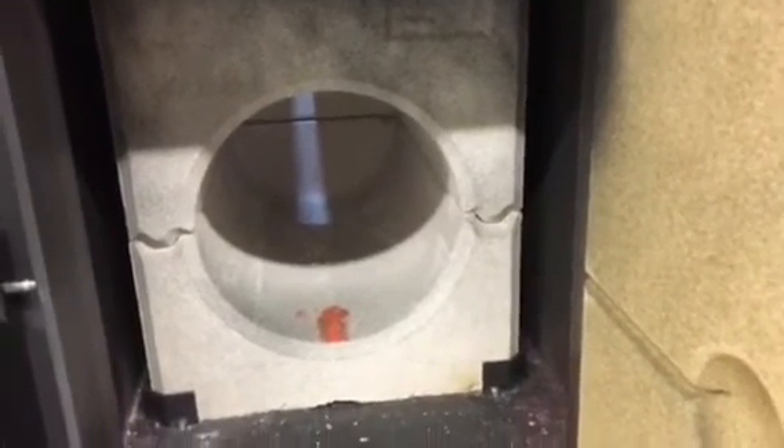This is the secondary combustion chamber, located at the base of the boiler. It's about 150 pounds and its cylindrical shape makes it really strong. This is a long-lasting refractory, and this is also the area where a lot of the ash is pulled out.